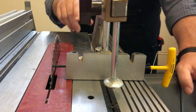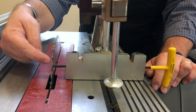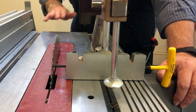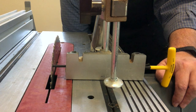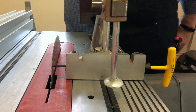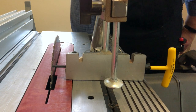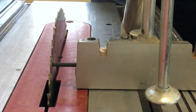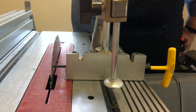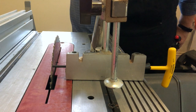I'm hoping you'll be able to see this. I've taken a hex wrench and brought it into the miter gauge slot, locked it in place touching the blade. The table tilt is locked, the carriage is locked, the table height adjustment is locked, the quill was not locked — now the quill is locked. Now I'm going to tighten the headstock. Watch between that blade and the wrench. And now loosen it. Tighten it. Loosen. Tighten. Can you see that movement? There's a couple thousandths of movement right there.